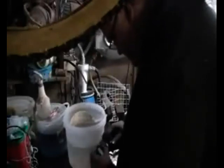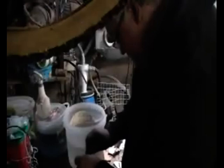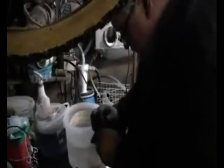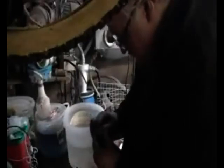Overall the process takes just over an hour, and gradually you build up a nice thickness of zinc plate on the part. One final burnish and a wire brush just to even out the shine, make everything look even and polished if you like. And then a wipe with a scotch brite just to sharpen everything up a bit — makes it look a little bit better.